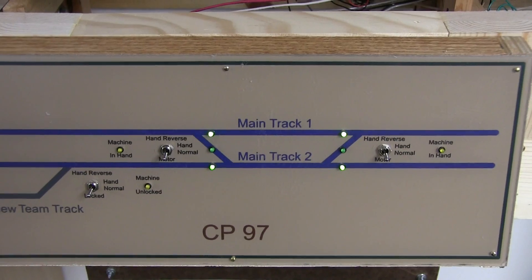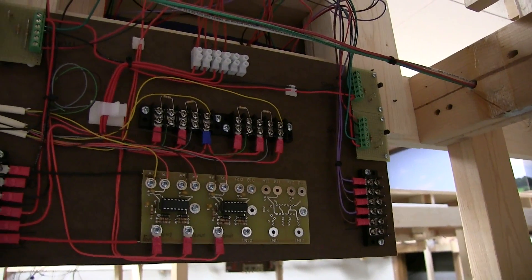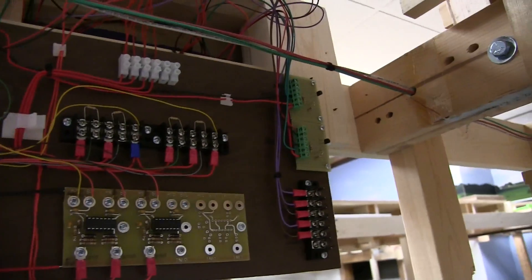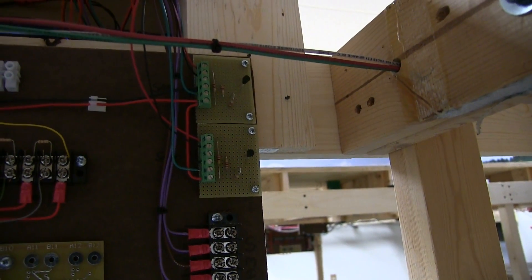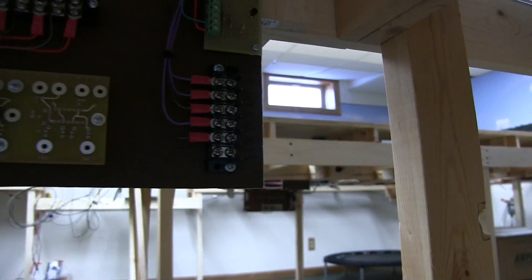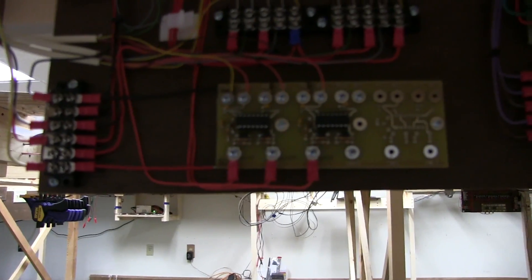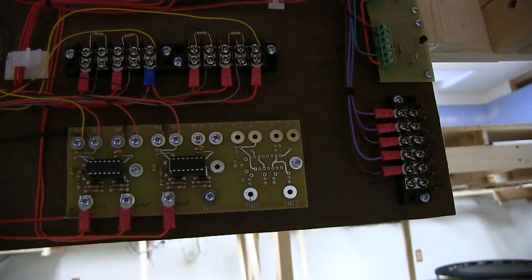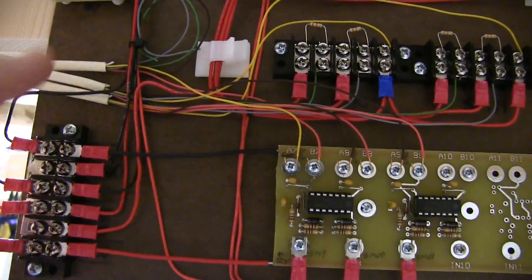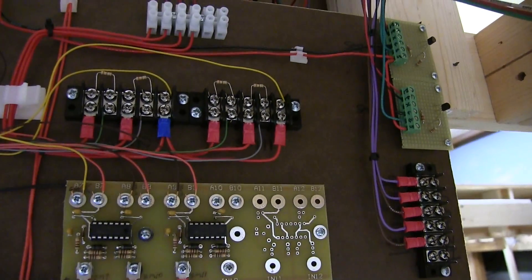This was done way back in my early planning stages. That's the front of it — it was a lot tighter. Here's the back of it. Again, the three cards there are for the motor and hand control, the feedback to the S-mini via the purple and brown wires, the SMC-12, and the ground. And the LEDs come from inside the cabinet. And obviously these are the wires that come from the turnouts themselves — from the tortoise machines — routed inside the cabinet.